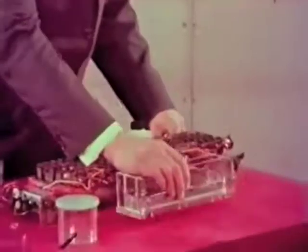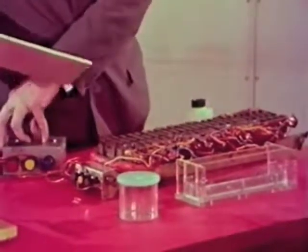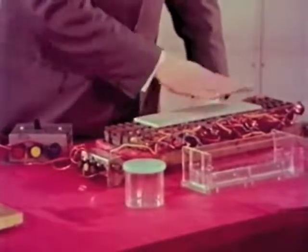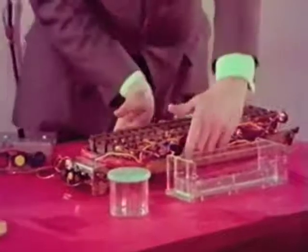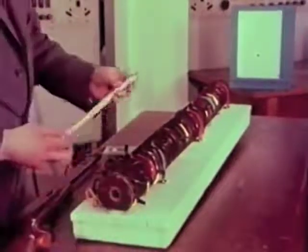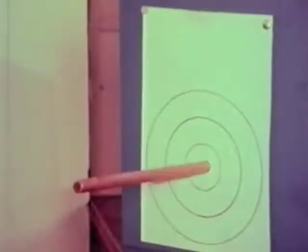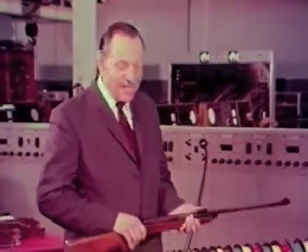Now this same magnetic field is much more potent if it operates on an aluminium sheet instead of mercury — aluminium is about 40 times more conducting than mercury. I could make it more potent still with steel behind the aluminium to improve the magnetic circuit, but instead I'm going to change the shape of the motor. Imagine the two sides bent upwards and the whole thing rolled up into a tube. The windings are then very simple — just a row of coils. The moving part is a steel rod with a copper sleeve around it. We put it in the end of the tube and fire. That wasn't a bad shot! This electromagnetic gun seems to have taken us right back to where we started.